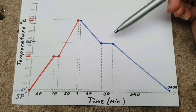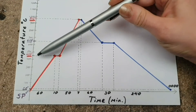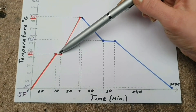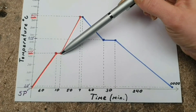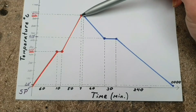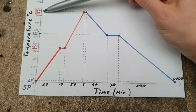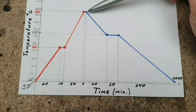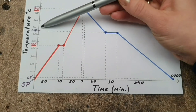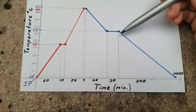If you look at my program chart, you will see three soaking positions. The first one is where I put 450 degrees for 10 minutes, so I put 450 degrees at the end of the soaking time. The next one, I enter 972 degrees, then I enter 7 minutes which is my soaking time, then I enter 972 degrees again to end my soaking time. And the same I do for the last one — I enter 650 degrees, then 30 minutes, and then 650 degrees to end my soaking time.